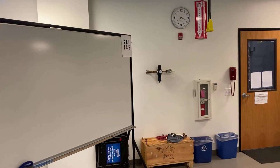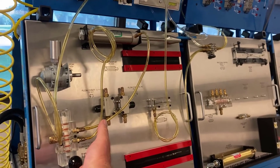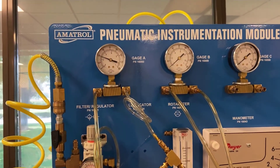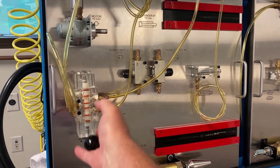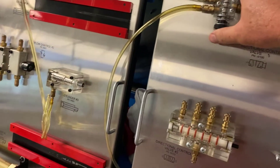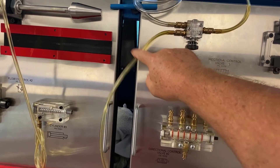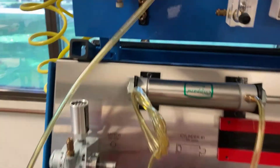We've got our air turned on, set to 40 psi — still regulated to 80 psi by the main regulator on the wall. Let's see what happens when I actuate this DCV: the rod goes both ways. If I go up it goes out, when I go down it comes back — pretty simple. That gauge up there is telling us exactly what's going on in this part of the circuit, and you can hear it venting out of the vent holes in the DCV, which are indicated on the diagram by a faint dotted line. Independent of that, because we plumbed into the T, I can push this manual switch and make that rod extend. When I let go, the rod retracts — you can see the tube moving because the air is exiting through there.